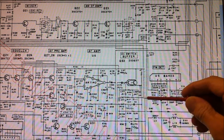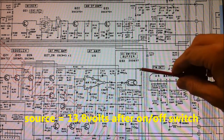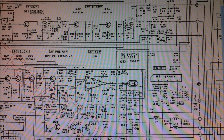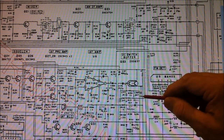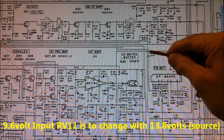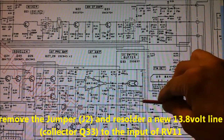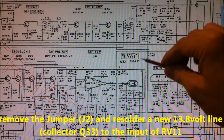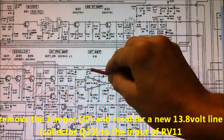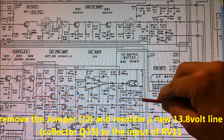This line here is the BAS line, the 9V line, and here we have the source directly after the power switch. The solution is: we break the track to the 9V point, to the BAS point, by removing this jumper here, and we make a new track from the collector of the Q33 source at 13.8 volts to the input of RV11.